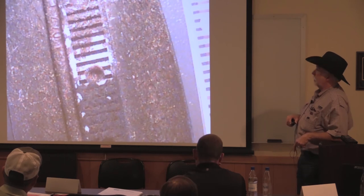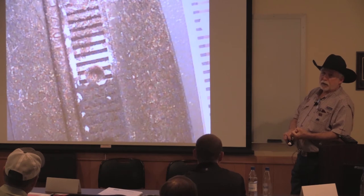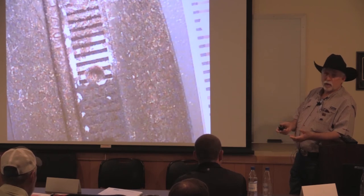You can clean this up, but you're going to have to use, number one, peroxide. Bring the pH down with acid, then inject peroxide. We actually figured that out. Jim Brodowski was looking at an old soils book on how to solubilize a manganese sample out of soil so that you could see what the manganese level in the soil was, and that was the solution: bring the pH down and then use hydrogen peroxide.